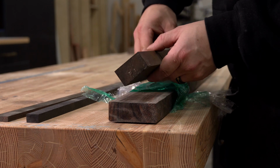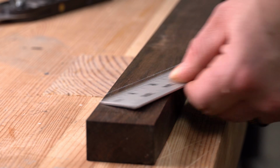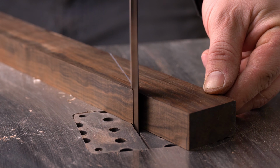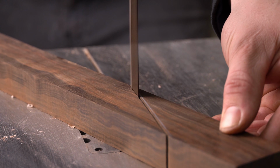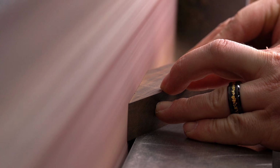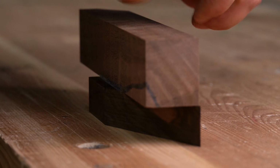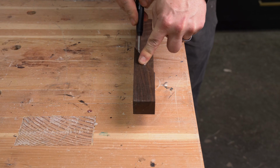This is B-grade ebony, and I've had it for about 6 years, ever since I built instruments. This will be the first accent that I deal with, which will be the bottom of the handle, but instead of just joining it straight, I'm joining it at an angle. These angles will start to play a larger role in the overall design, but you'll actually see as we progress, I'm choosing very carefully how I do this joint.